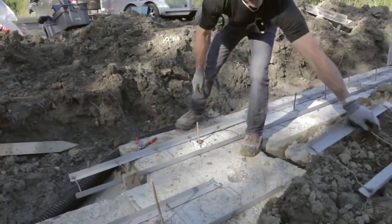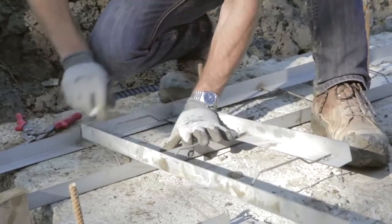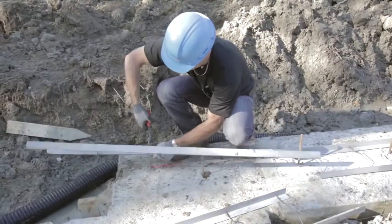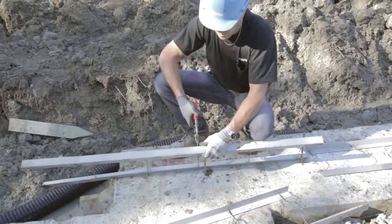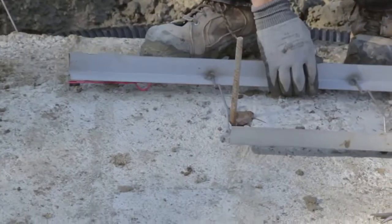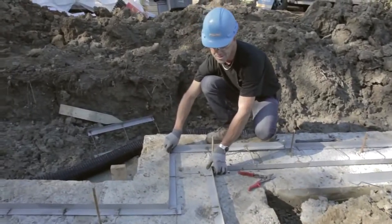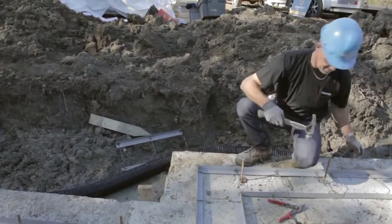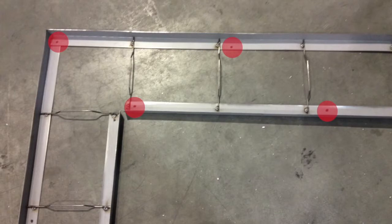Starting base exterior perimeter drawing with a chalk line. Starting base corner cutting with the appropriate cutoff. Starting base fixation with concrete nails or ramset gun type. The nails have to be put 2 feet apart, alternately on each starting base side. It is recommended to install the starting base the day after footing pouring. Nails will penetrate better in fresh concrete.